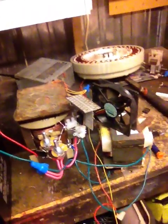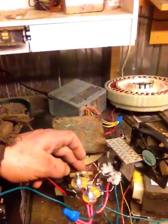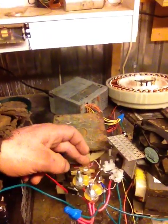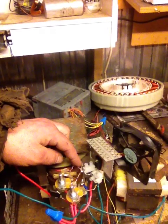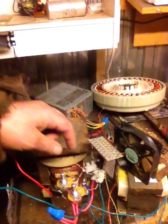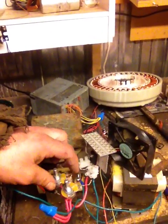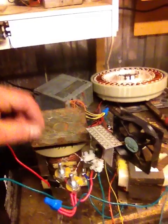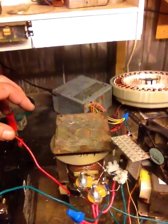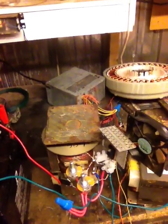The way I did that was — well, these two pots aren't actually being used, they're just in the circuit still because I reconfigured it. And this diode's twisted around so it's shorted out — it's just a bridge there. I've got a 1K ohm resistor on this side of the base, and then on my output I've got this potentiometer. You can adjust your frequency a little bit with the potentiometer, but it doesn't change it too much — it mostly just changes the amperage at which you're pulsing into the battery and out of your source. So I've got 1K here and 1K here.